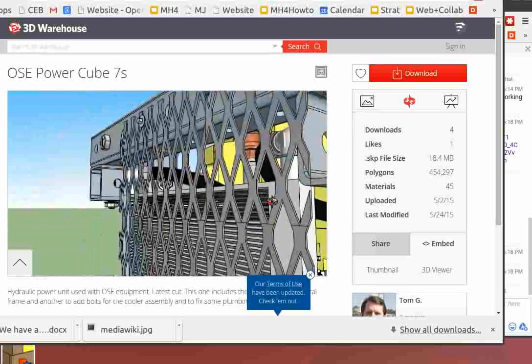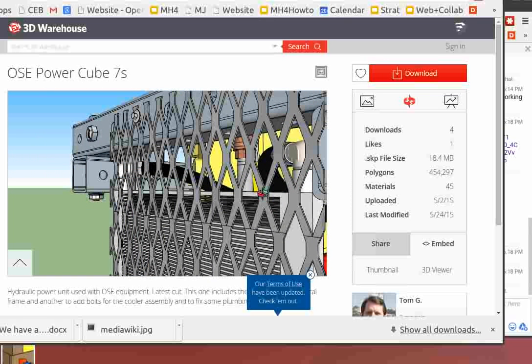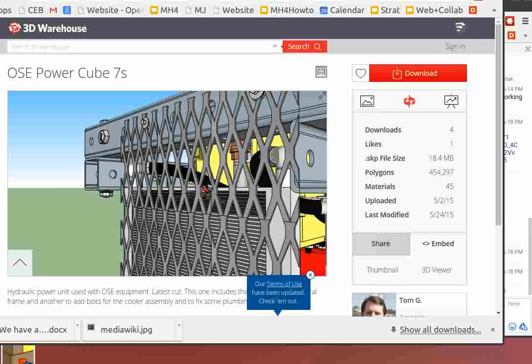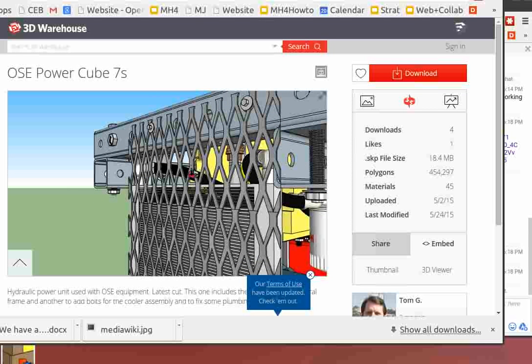And the mesh itself, if we wanted to make that really, even stronger, would be to put a bar across the top of the mesh, and then bolt it down with like 1-inch bolts so that thing is not going anywhere. Because each 1-inch bolt or 3/4-inch bolt, you get tens of thousands of pounds of clamp strength.